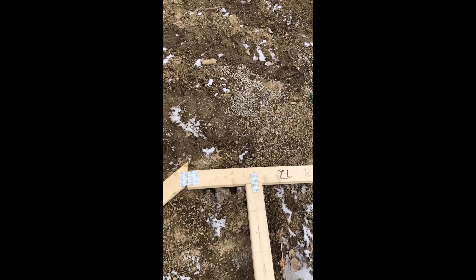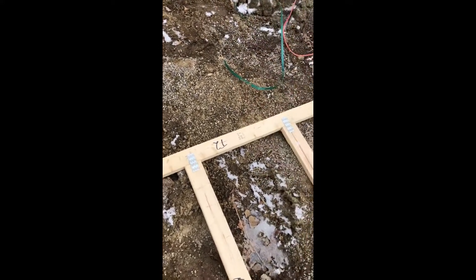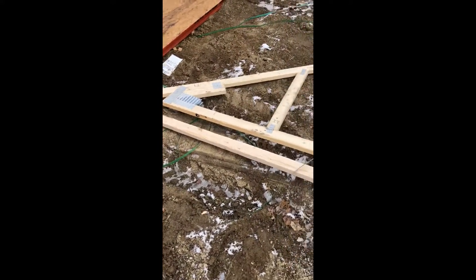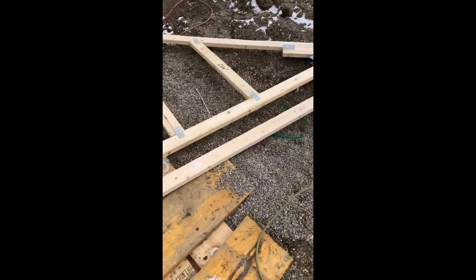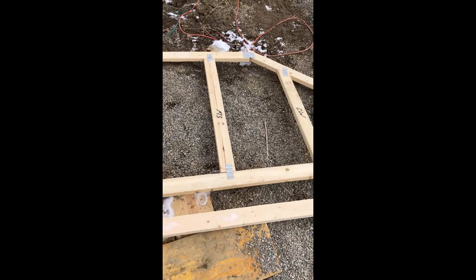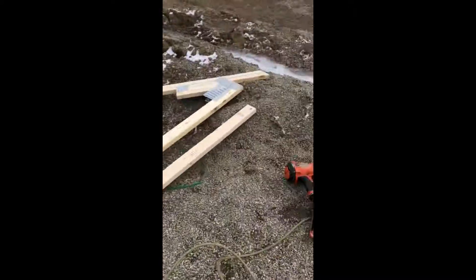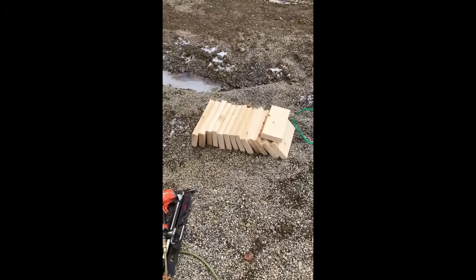It's also going to be 10-12. As you can see, I have a pre-cut piece of 2x4 that will be nailed after the gable — it's going to be a drywall nailer. I also have a bunch of 2x6 blocks.